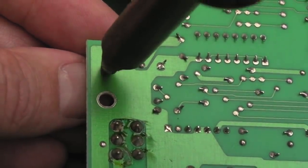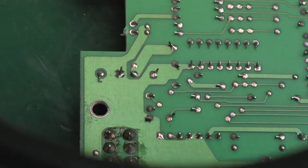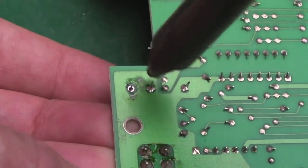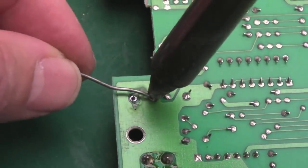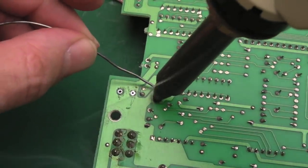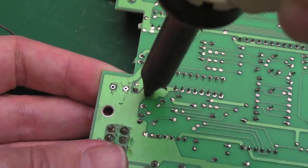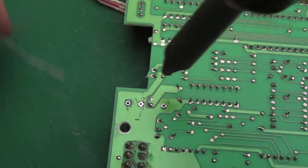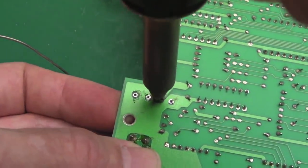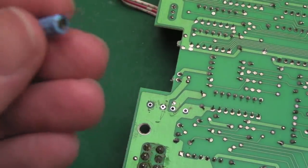Using the desoldering station here, but you could just use a cheap soldering iron and a desoldering pump. Let's add a bit of solder first because it will flow better with fresh solder that contains flux. On the ground side you might need a little bit more heat because the thermal mass of the board and the metal is going to absorb the heat. On the positive side it might be a bit easier. I've got one cap off there. I had to cut that because my desoldering station blocked - it's not blocked at all since I did the review, but today it blocked. I think it's just because I didn't let it warm up enough. You can see the solder's gone - let's get a bit of fresh solder and flux onto that point.